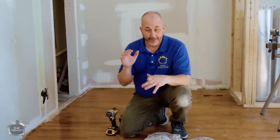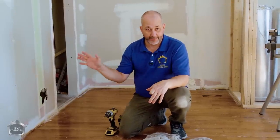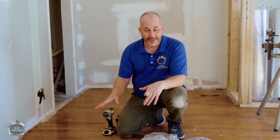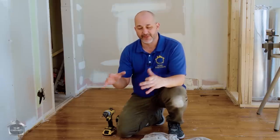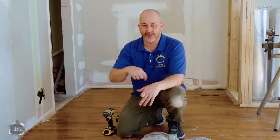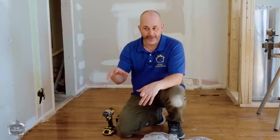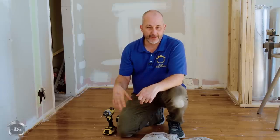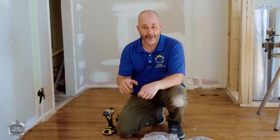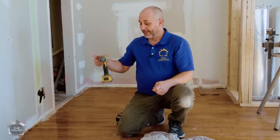We have lots of taping to do, but we're going out of order with construction because one of the benefits of doing the floor first is I get to install all my door jambs, doors, and baseboards on top of the flooring. It avoids a lot of silly little trims and caulking later on.